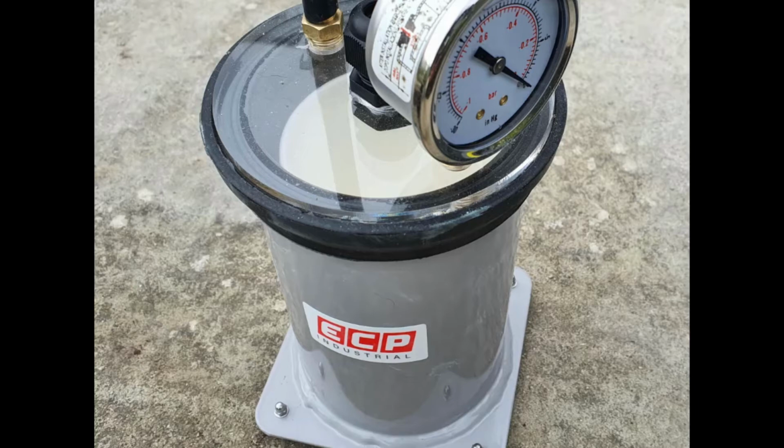So between the mould and the pump, you put one of these pieces of equipment. This is a catch pot and it does exactly as the name suggests. Any excess resin drawn through the vacuum infusion line is then caught in the catch pot in the paper cup. Once the job is completely cured, the paper cup is then removed and thrown away.